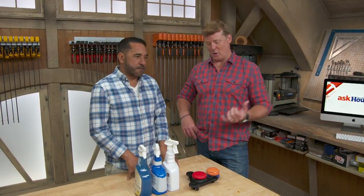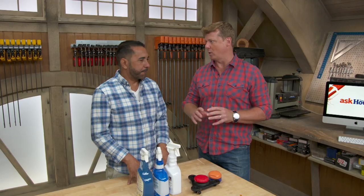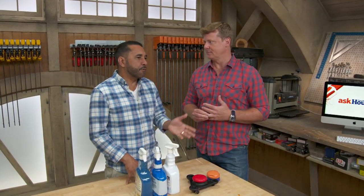This was pretty straightforward. You had the right surface behind it, only one layer of wallpaper, and there wasn't any paint, so the vinegar and hot water works. Chemicals might be the next step up if needed, but my number one preference is to start with the easy way, the way we did it here. Thanks for watching. This Old House has got a video for just about every home improvement project, so be sure to check out the others. And if you'd like what you see, click on the subscribe button to get our newest videos right in your feed.